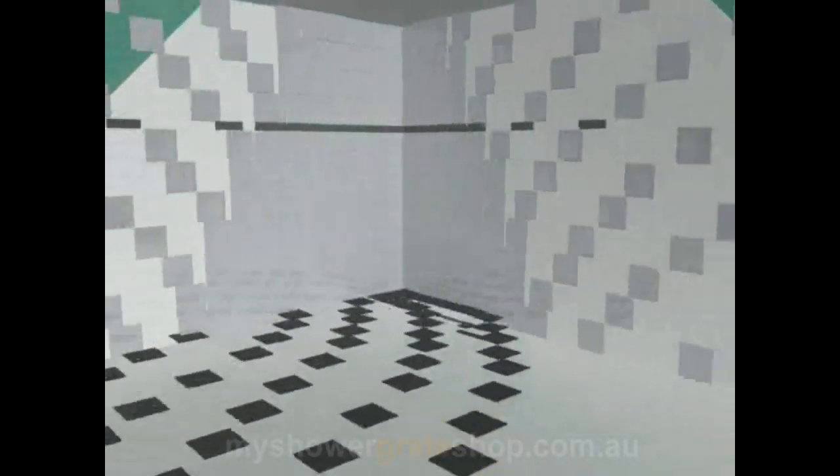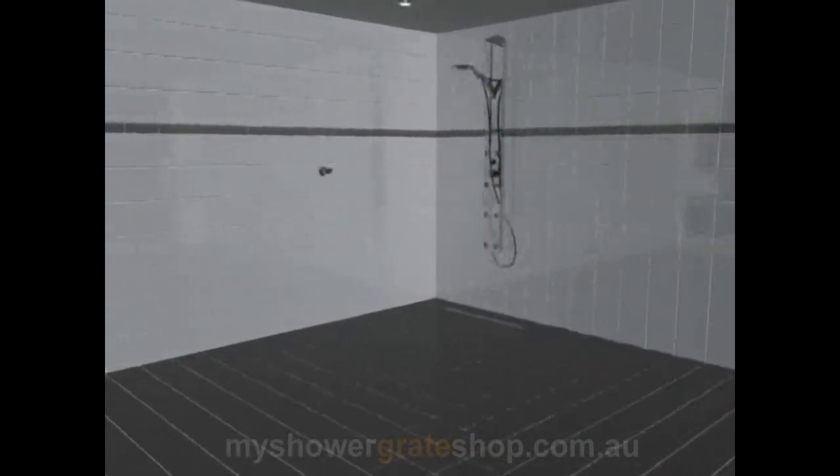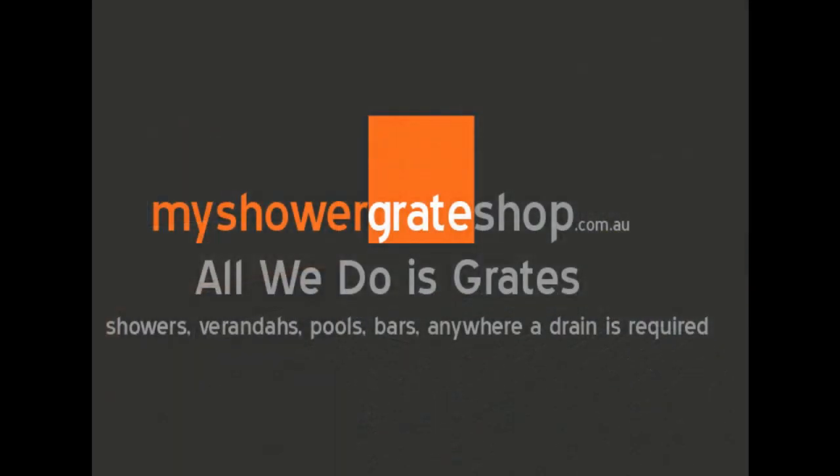The next step for the construction phase would be to do all the tiling on both the floor and the walls as shown in the diagram. After that, any grouting would be done, and then silicone beads in all your floor wall intersections. Then all the furniture is reinstalled as to where you require for your bathroom.